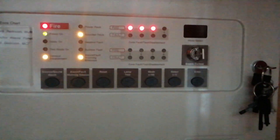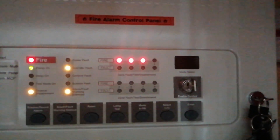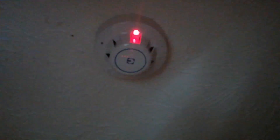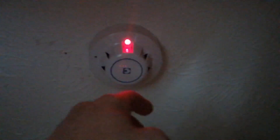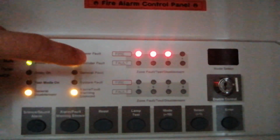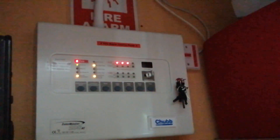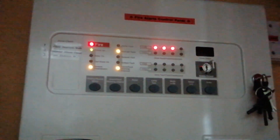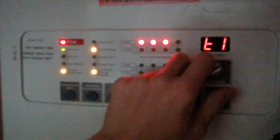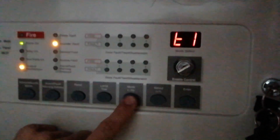I really do like these panels — I've wanted one for quite a while and I just saw a really good deal. I'm going to let these clear out for a minute or two, wait for the aerosol to clear and for the other sensor to cool down, then we'll come back, re-enable the sounders, and reset the system. It's now been a few minutes, the sensor should have cleared, so we can reset the panel and re-enable the sounders.